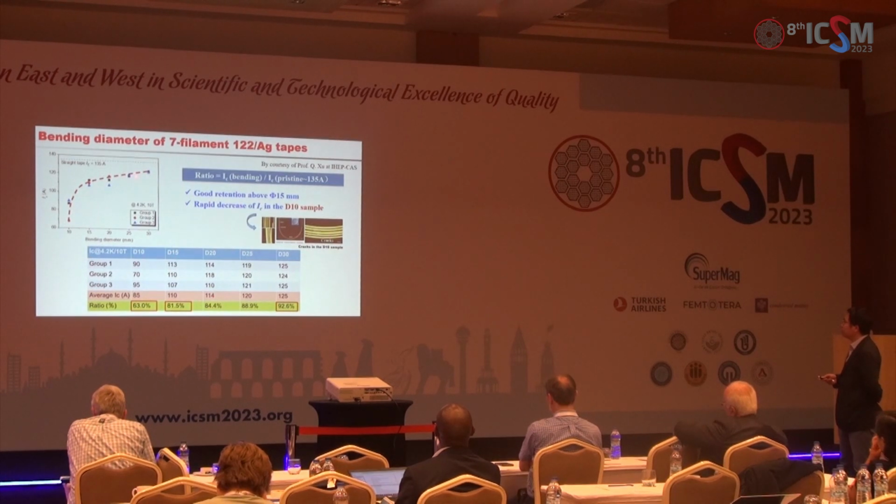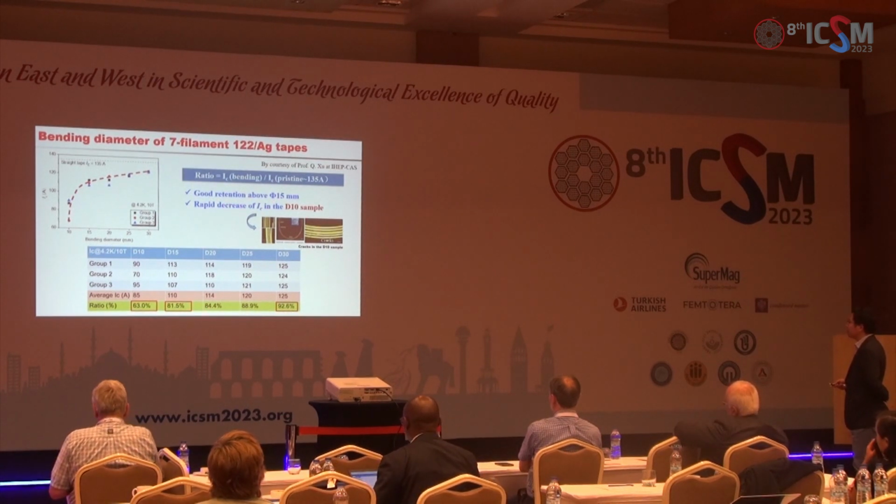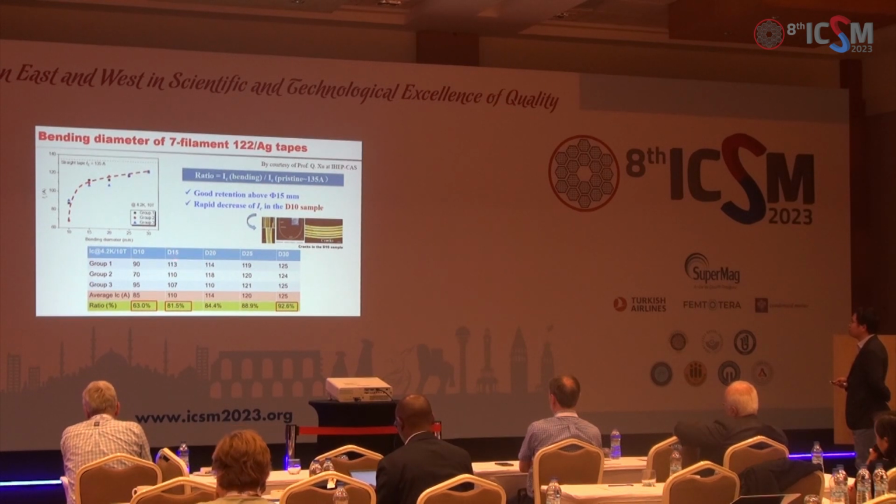So they found that there is a very slow decrease of the Ic retention, and the ratio remains above 80% when the bending diameter is larger than 15 millimeters. But below this level, there is a sharp drop of the critical current.